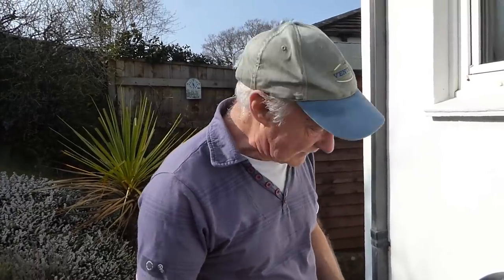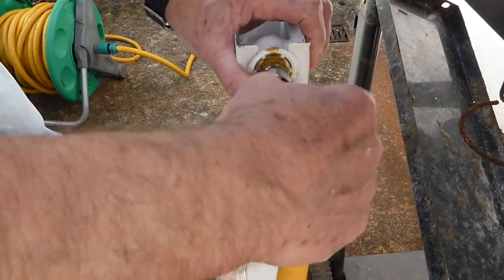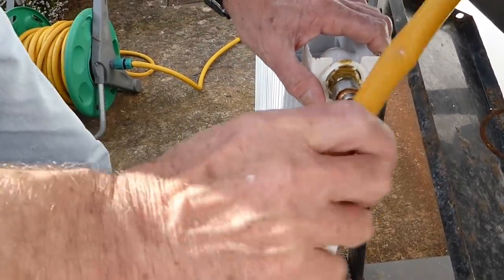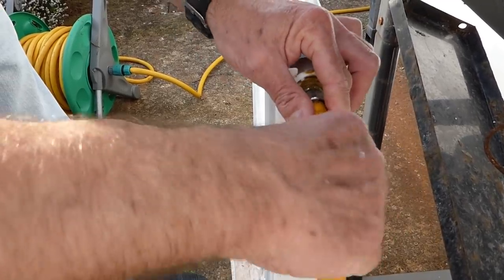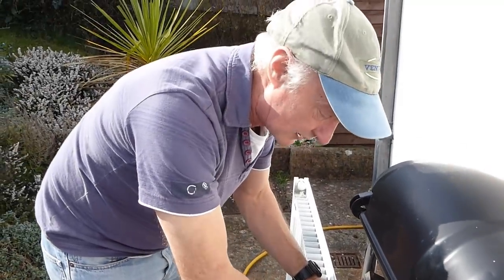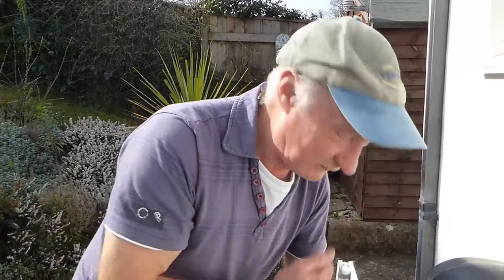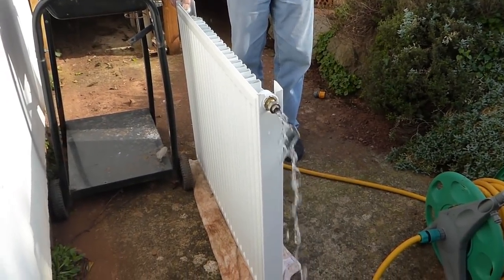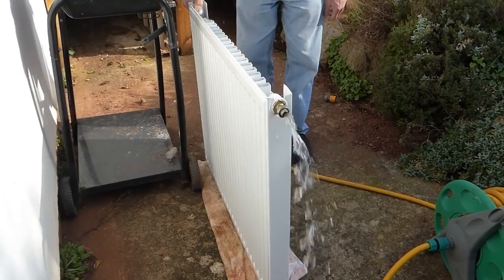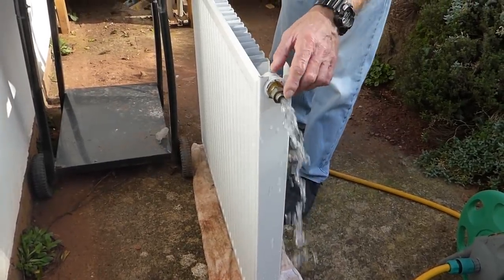We have our hose connected to the outside tap. If you've got these nice little thin nuts it's very easy to get a hose on to flush it through. There will be a bit of back pressure, so be careful holding it. This radiator is actually clean — it's indoors and works fine — but I'm just showing you this if you've got this problem at home, so don't expect to see too much black out of this one. If you've got this problem badly, you'd get a lot of black horrible sludge out of there.